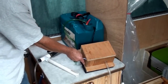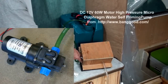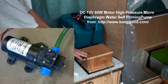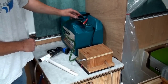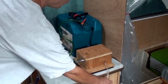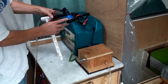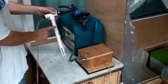The pump itself is a 12-volt micro diaphragm pump, 60 watts, doing about 5 liters per minute — which is a lot. It's a little noisy, which is why I've got it in a plywood box. The inlet goes to the water container using 3/8-inch vinyl hose, and the outlet is also vinyl hose going to a garden spray nozzle with various settings, which is very handy.